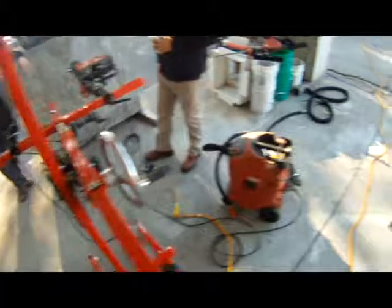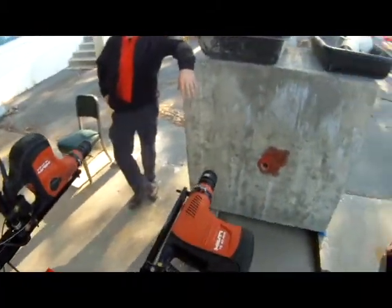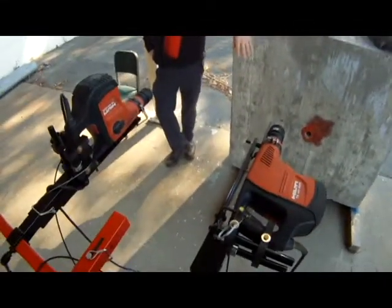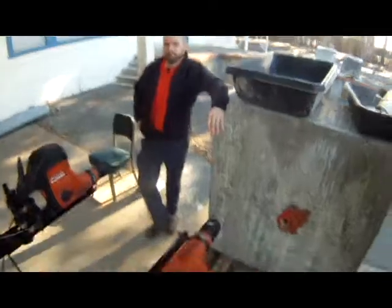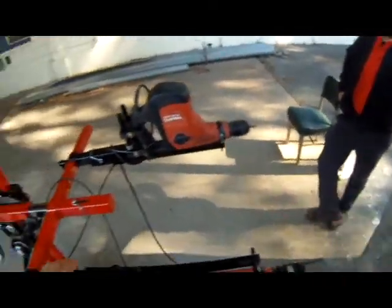Because let's say you didn't have space or you want to have the drill supported this way. Well, for me, this is how I do horizontal drilling. I don't have them flying out like this. I typically have them either down like a regular drill or I have them inverted. But it'll go either way. What's important is that they both be the same. They both have to be the same because as we do that, we change the relative position of the bit.